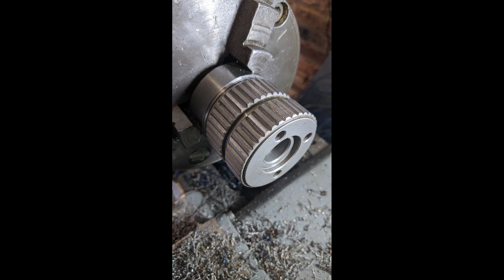Here you can see the body sitting snugly on the post. On the base you can see three holes which can take a peg — six millimetre I think. The peg can be used to lock the body to the base so that it can't turn if there is a high turning force when making heavy cuts. The three holes are spaced so that you can index the body by a third of a tooth, effectively giving 120 positions.